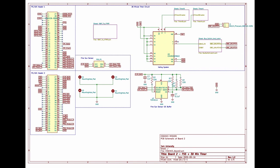The timer circuit schematic consists of 4 main sub-circuits. The first 2 are the timers themselves, RC circuits whose time constant aligns with our 30-minute requirement. At approximately 1800 seconds, the output is pulled high to VBAT. 2 timers are used for redundancy. The output is then passed through a multiplexer to what's referred to as a latching circuit. Here, a floating wire that drives a so-called kill switch is pulled to ground, and that activates the NanoPower P60 dock unit and powers the entire satellite.